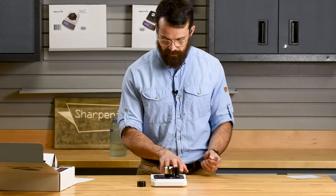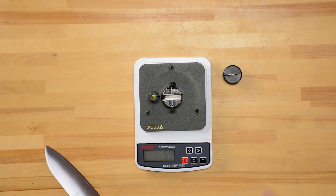You want the lowering to take about four to six seconds, and you want to be able to see the numbers increase. If they're flying and you can't really read them as they increase, then you're moving too quickly. Generally, you can't lower it too slowly, but you can lower it too quickly — lower it too quickly and you're going to end up with an inaccurate test.